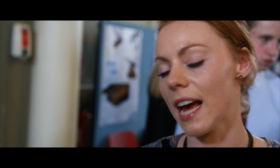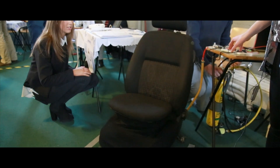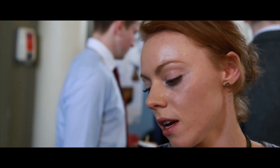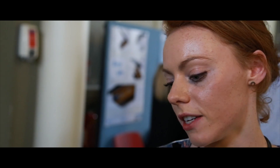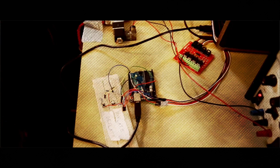We also have an emergency stop should things get out of hand. This is the auto seat — it's a retrofit for the car seat which allows you to raise and lower it for ease of access. There's also rotary actuation, which allows you to turn in and out of the car more easily. We operate it using pneumatics, which is compressed air. The compressed air inlet and outlet is controlled by a solenoid valve, which is an electromechanical valve, operated using an Arduino, which is a mini microcontroller.